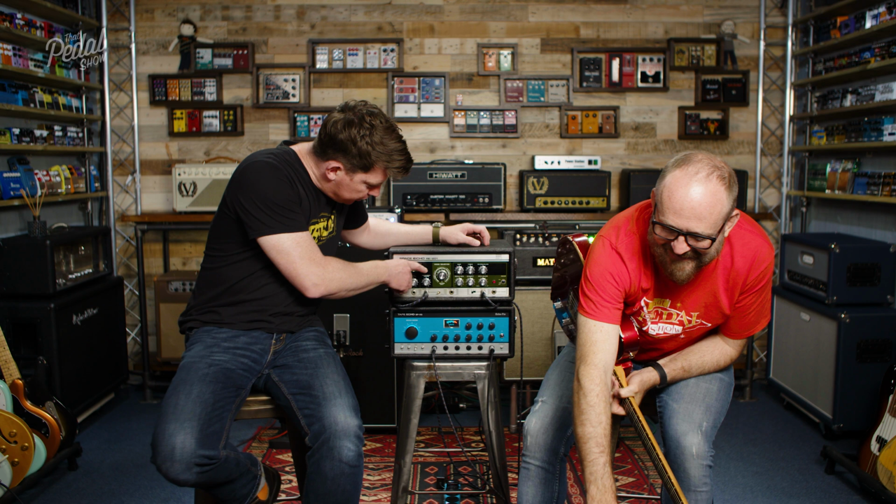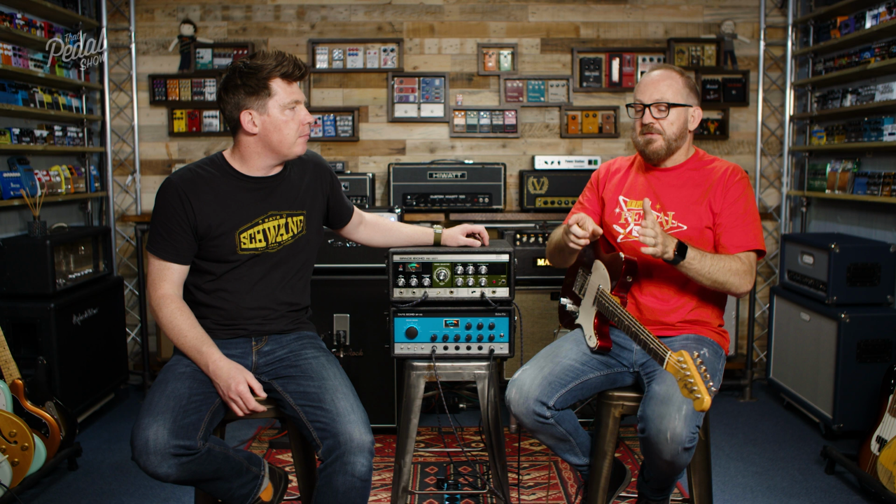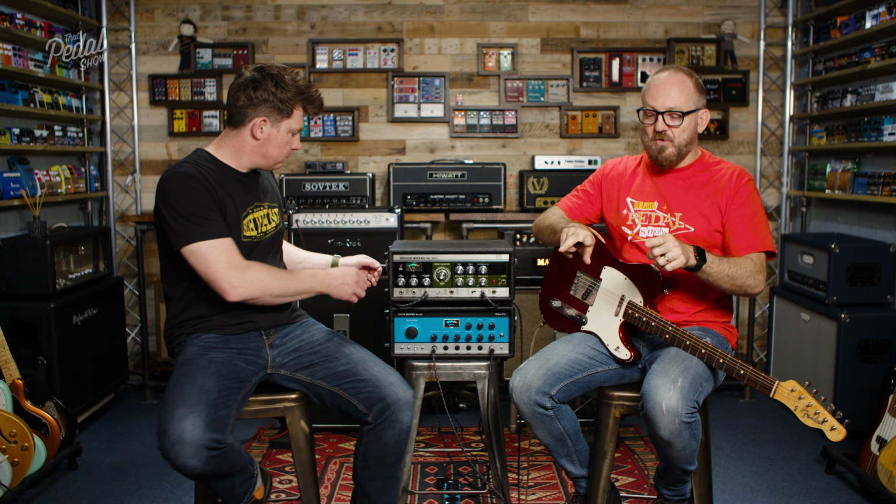Number seven. What is that, do we think? It's one of the heads. Yeah. So if you think about it, you've got a number of playback heads and a record head. The further the playback head is away from the record head, the longer the delay is going to be.